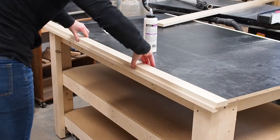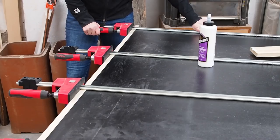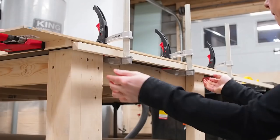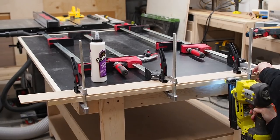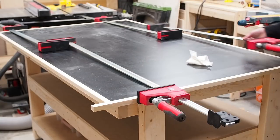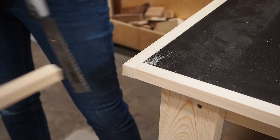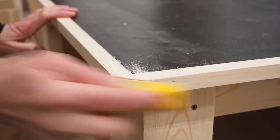I'll then throw on some clamps. I'll be honest and say I'm not sure this will hold, as I don't think gluing wood to particle board is the most solid, but we'll see. If it shows signs of coming undone, I'll likely add some visible through dowels, or simply add some screws. As you can see here, I did one side at a time, leaving the trim long, and then used a flush cut saw to trim it down to length once it had dried, and then repeated the process for the next side. I then sanded and rounded all the corners, and also made sure to break the sharp edges as well.